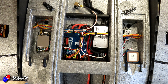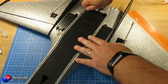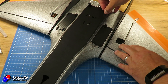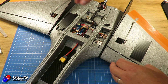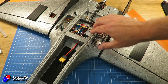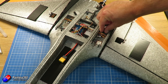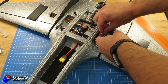It's just a case of making all the connections as per the diagram for the F722. With it all connected, it looks like this. Everything has fitted really nicely in here, but it has taken a little bit of work to get the cabling quite neat. I've tried to make sure there is just enough cabling to keep track of everything. The only cables I haven't cut are the cables for the servos — I've left a little loop of cable inside the two side pods so that if the wings are disconnected slightly or pop out of position, it's not going to put too much strain on those individual cables.